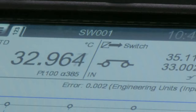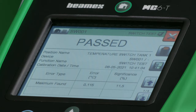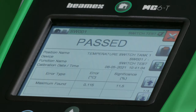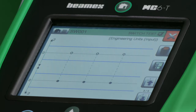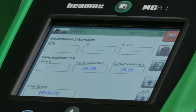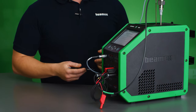The calibration has just been finished. We have three passed set point results and also three passed reset points. I can now go through my results on the screen. I see what type of errors were recorded. I can enter a note, and this note will then be present on the calibration certificate. I can see my results in a graphical view, numerical view, and also enter environmental data if needed. I'll save the results. Job done.